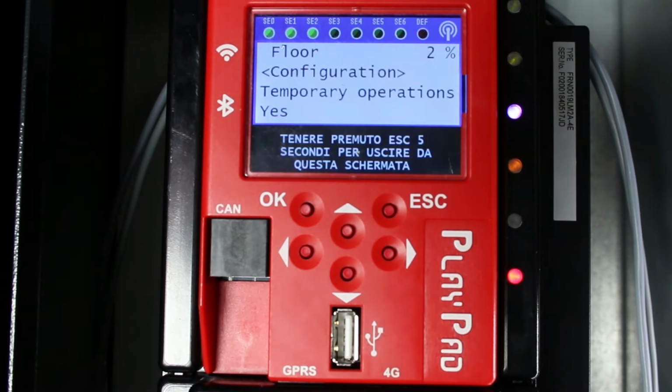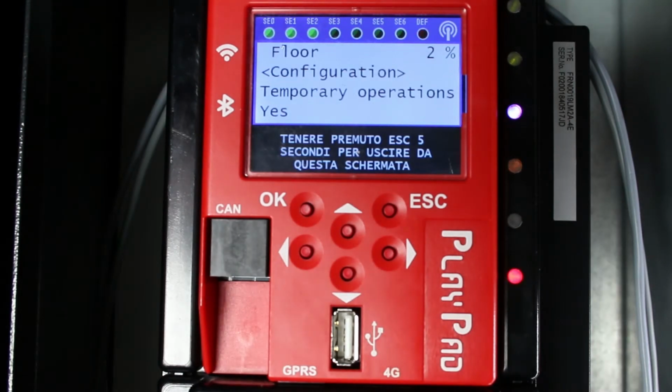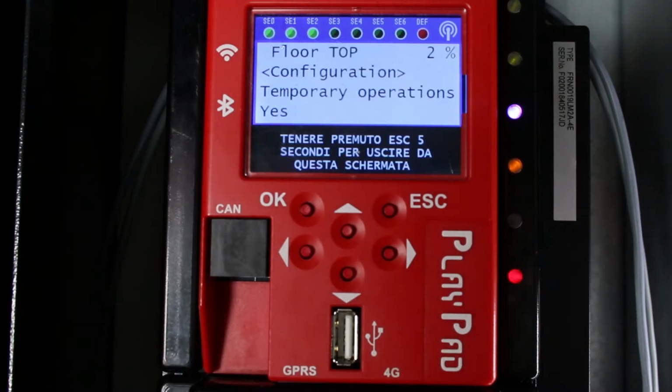The mode LED turns on and an acoustic feedback can be heard, a beep every 2 seconds. This acoustic signal will stay active during the whole procedure of the first phase. A flashing message will appear on the programmer with the text "Top".